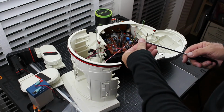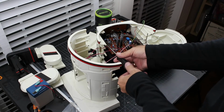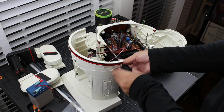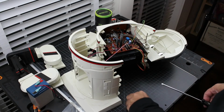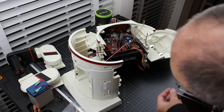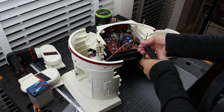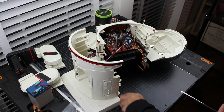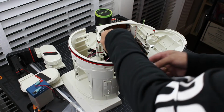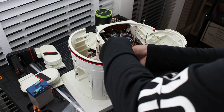Well, this is going to be probably the easiest fix or non-fix I've ever done. But at least you got to see, like I said, the number one thing when the tape unit isn't playing is the belt. And it's a lot of goop that gets messed up inside there when the belt melts. And you have to just start taking alcohol to it, cleaning up all the residue, all the melted rubber residue that's in there.